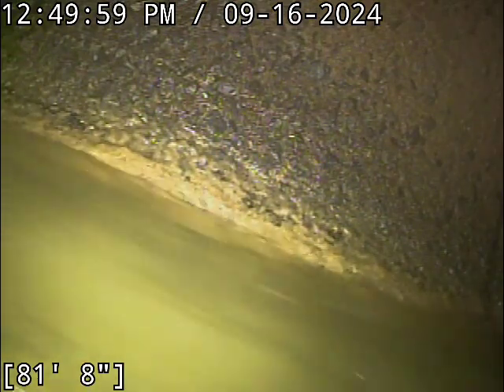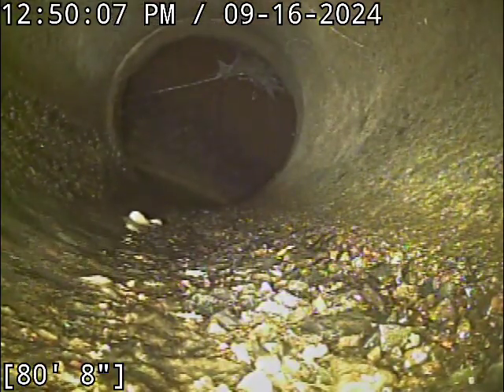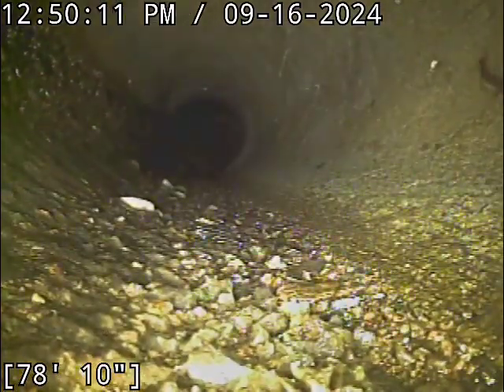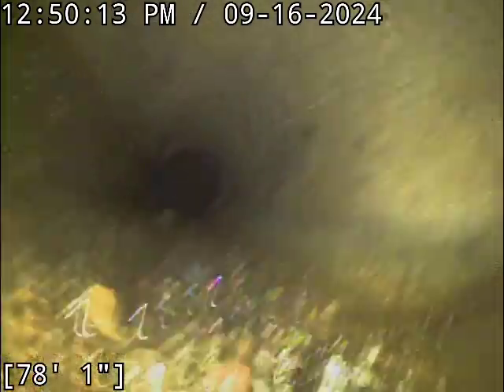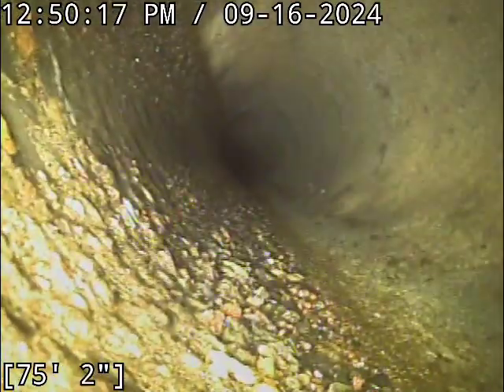Located the camera head successfully. Line terminates on Southwest Dakota Drive. The line ends up making its way out and orienting fairly close to the right side edge of the driveway — as you face the house from the street — but it turns before getting to the driveway. Probably crossing the curb three, four, five feet to the right of the driveway.